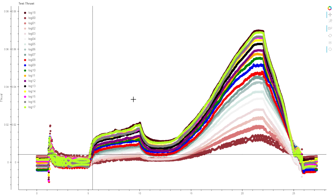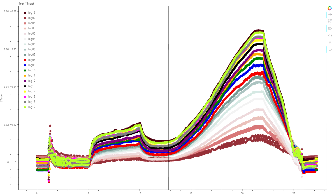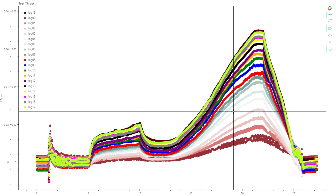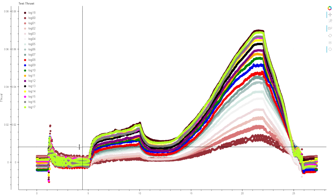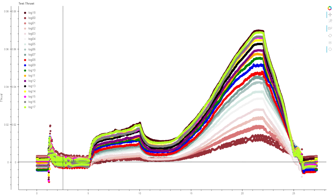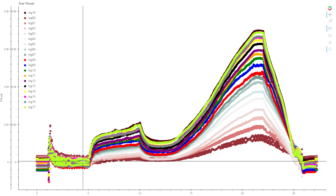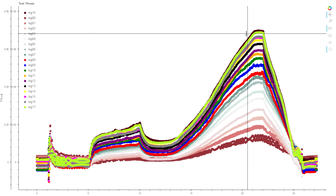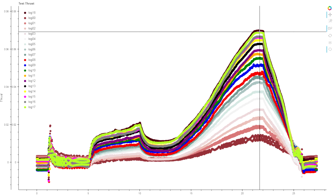If you spin the motor up and I apply a torque, and then I slow the motor down and spin the motor up a second time, then I get this drift in those results as well. So unfortunately, it doesn't give me a perfect zero, because I have to spin the motor up to get this very, very tiny amount of torque applied to the torque arm to zero out. So my absolute peak reading is probably going to be just a little bit shy.